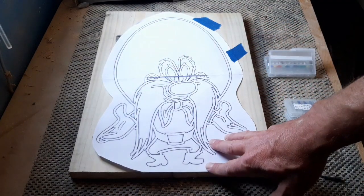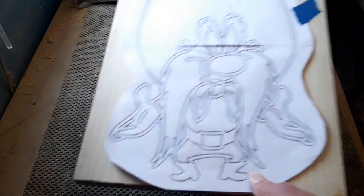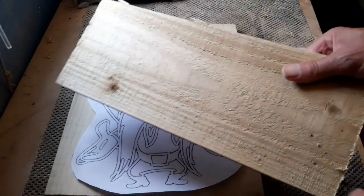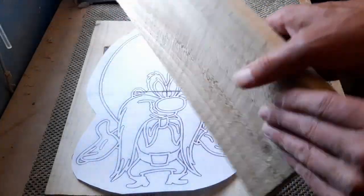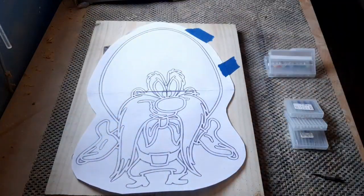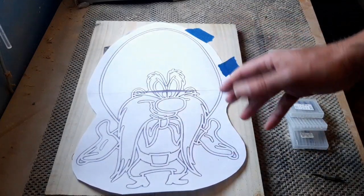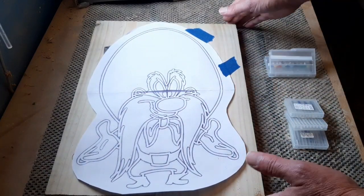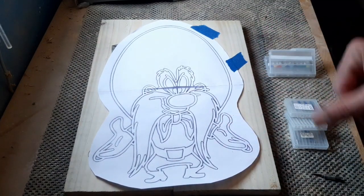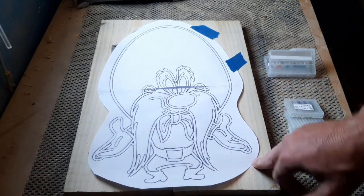We've got our template ready, you can see from that, and it's just on rough fencing wood. I use this a lot on all my projects in the garden. When you buy it, it comes like that, and it is quite rough and ready, but it's fairly cheap to purchase here in the UK at least. You spend 5-10 minutes or so just sanding it all down with a belt sander, and it comes out really smooth. It's ideal for anybody that's just starting out and you don't want to waste too much money getting all your fancy woods and stuff.